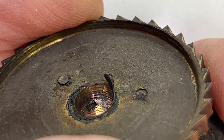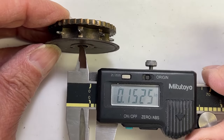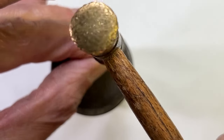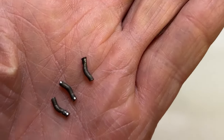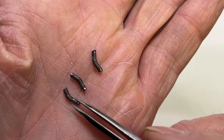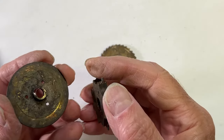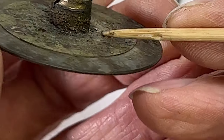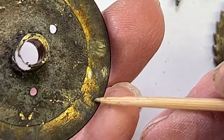The ratchet is loose from the main wheel. I'll check the amount of wear and remove these rivet pins. The rivets are all bent — this condition had to have happened when they were installed. Guess they wanted to make sure they were long enough. Separated for the first time in about 160 years, and again, all these are cast brass parts.